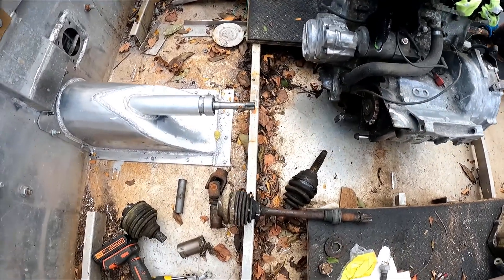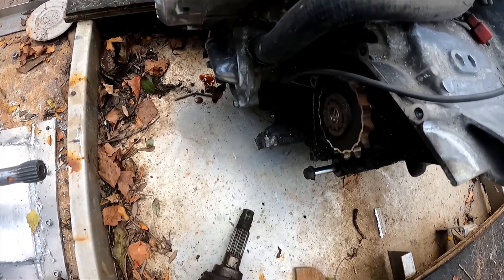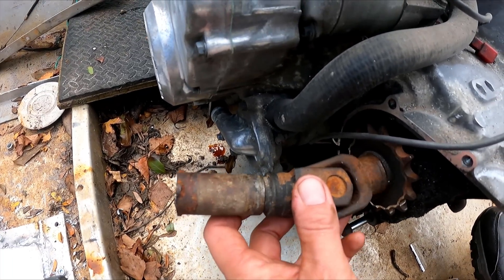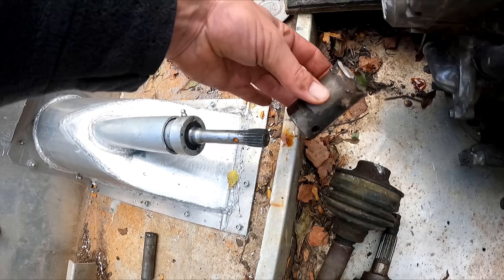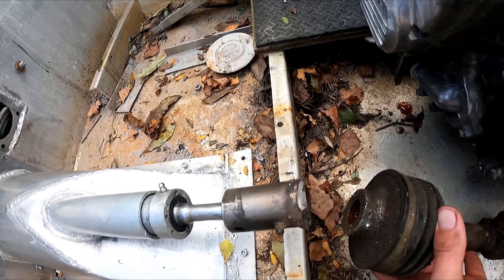The only option is to move it further forward. I think the motor is going to sit probably about there. I've got a bunch of old four-wheeler universals and CVs and I'm going to make the drive shaft. I think I've got a plan - weld this to there and this can be the drive shaft here. This big CV will plug into here - it came with the jet unit and has the same spline - I've just got to figure out a way of joining that to that.